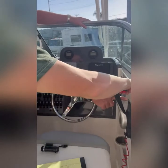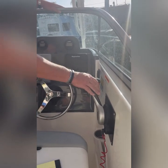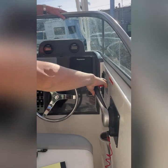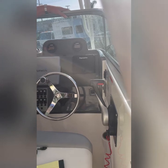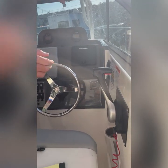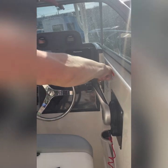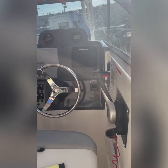From here to here is kind of a no man's land — you've got to move through that range quickly. You can feel it — that's in gear, that's forward, and that's your idle in forward. You'll feel it click in. Opposite of a Duffy — you don't want to go any slower in here because basically your clutch is not engaged and it's going to ruin the engine. Just go from that point to that point really fast. That's about three miles an hour.